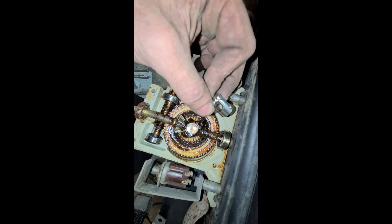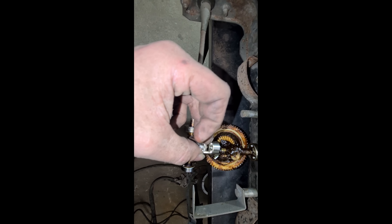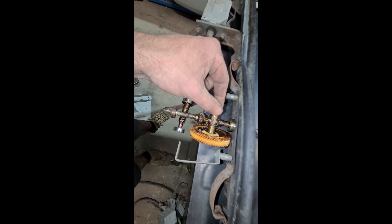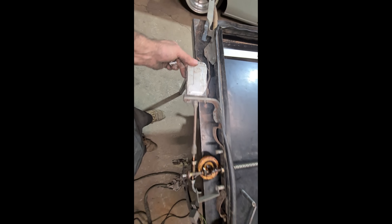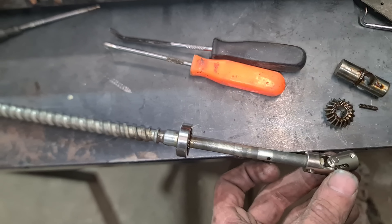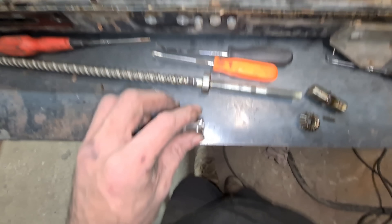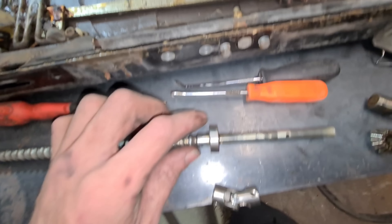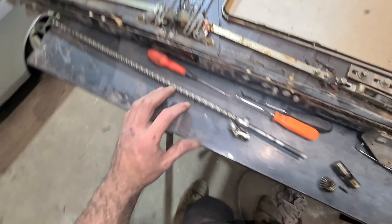Taking into account when I extend this say 60mm, I'll probably put the uni-joint somewhere around here. I won't bastardize any of these gears - I'll take them off properly because there's probably someone out there that actually needs one, and I can't imagine these would be too easy to get. I've got the gears taken off and the uni fits perfectly. Now I just need to determine the length and where it needs to be. I'm going to leave this bearing on there just to hold the shaft - might as well put a little carrier for it on the end here for a bit more support.